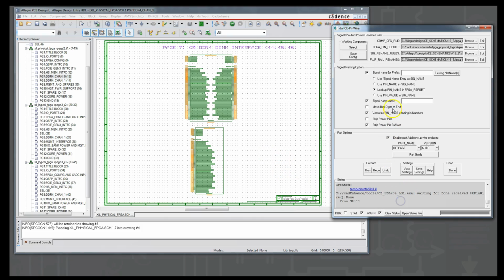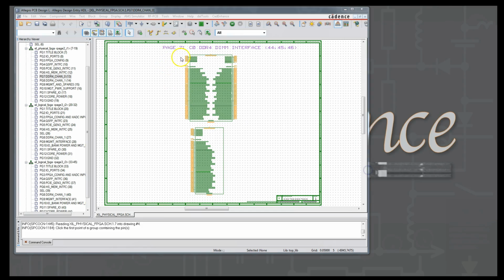Here we show that PinWire can add pins to more than one symbol at a time. We create a box that surrounds the pins on the left-hand side of 2 symbols, and then click out to the left to mark the endpoint of the wire. PinWire adds the wires to both symbols.